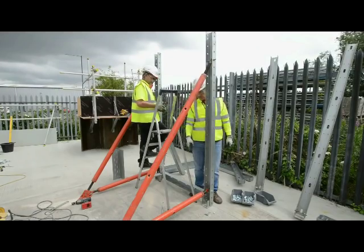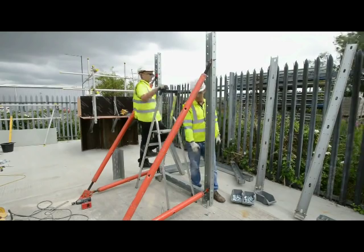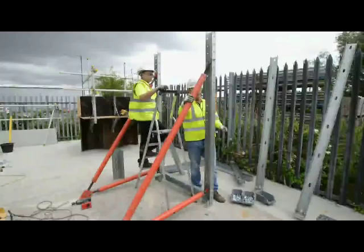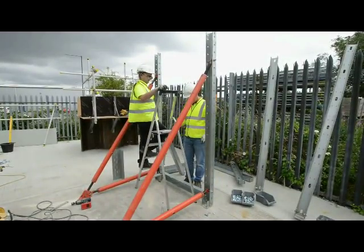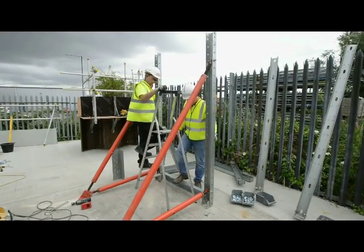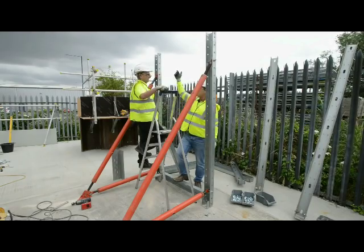The plumbing of the brackets is very easy. The bottom was obviously set when we put the roll bolt in anyway. And then we just turn so it's plumb. Very easy. What we're going to do now, we've got two uprights on. We've got the bottom one intermediate bracing loose. We don't tighten them up at this juncture. We're starting at the top and work our way down.